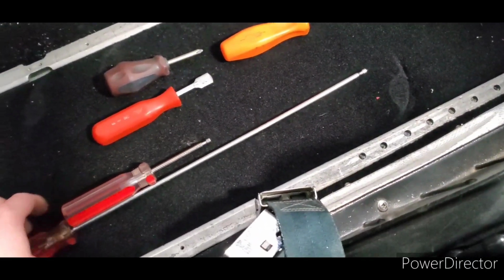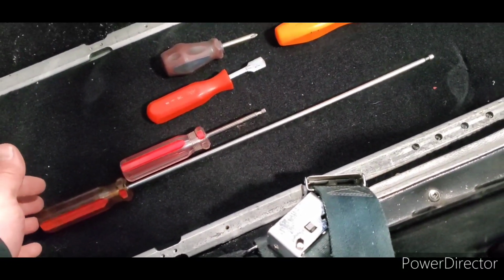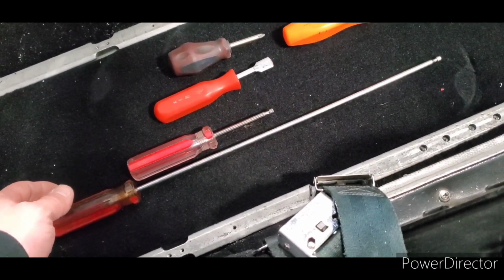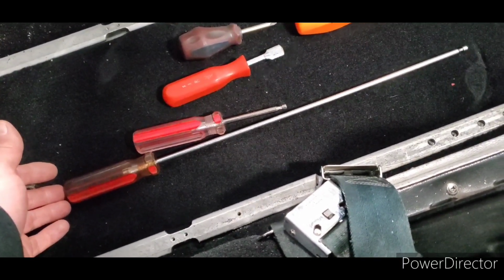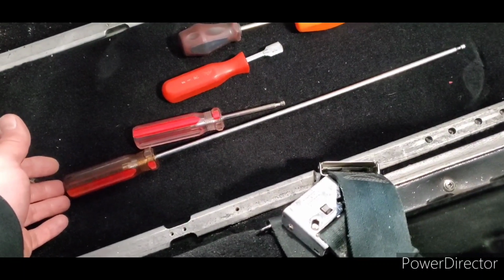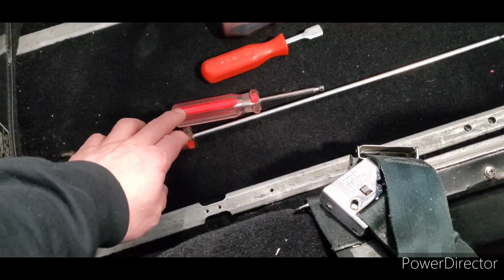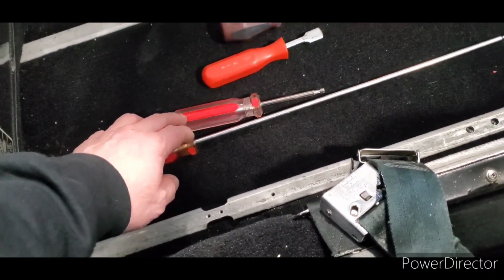And I found this on PT6 engines, turbine engines in general, there are spots, especially if you're working on a Caravan, because the bleed valve for the P3 air for heat, and also drives all the pneumatic stuff on the airplane, is buried down inside of a well, and you just can't get to it otherwise except with something like this. Your regular jet twisters, good luck.